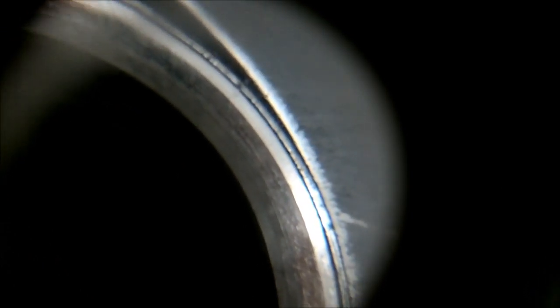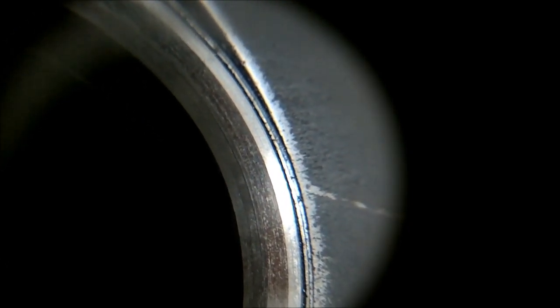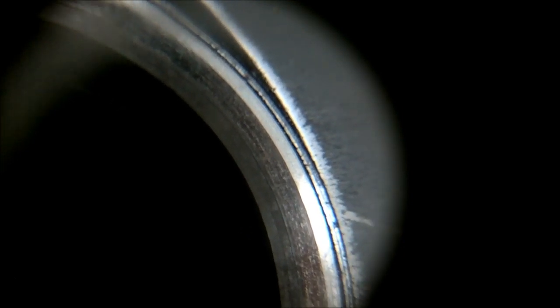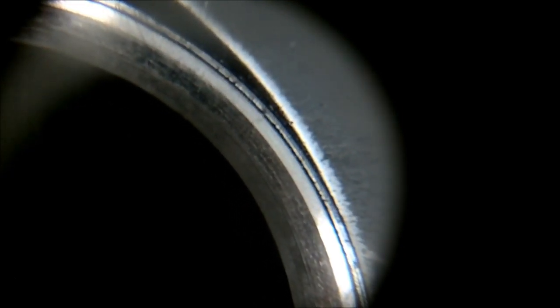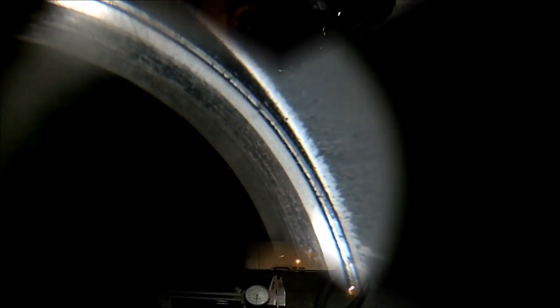There's a nice crack in this valve seat. I would have never noticed this if I hadn't been using a jeweler's eyepiece — an eye loupe — to check my work and my seat width.